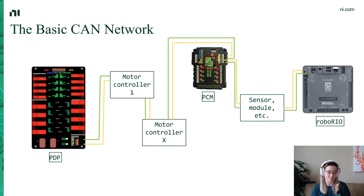Let's talk about a basic CAN network. The topology recommended for FRC is called a daisy chain topology — you start at one end, hook each individual piece to the next one, and end at the other end of the network. For FRC, it's important that the PDP is one end of the network and the RoboRio is the other end. It doesn't really matter what order you put all the stuff in the middle — motor controllers, pneumatics control module, sensors, other modules — but it matters that the PDP is at one end and the RoboRio is at the other. There are other CAN network topologies out there; if you choose to use one, just make sure you've done your research.